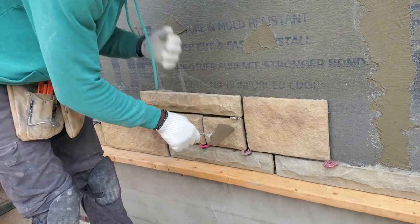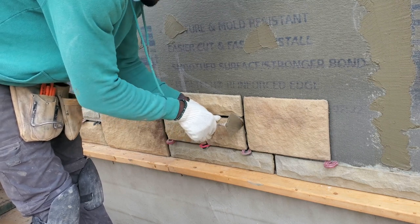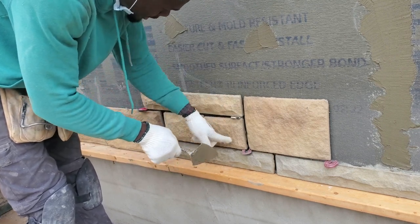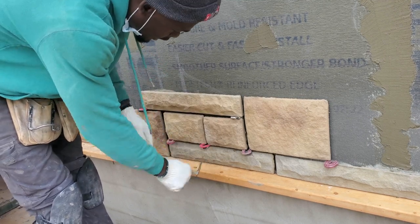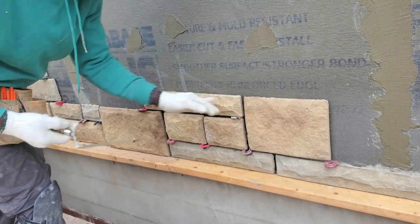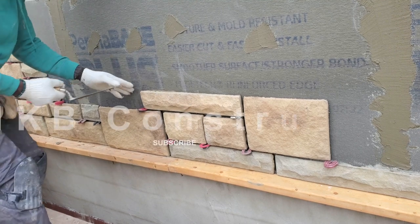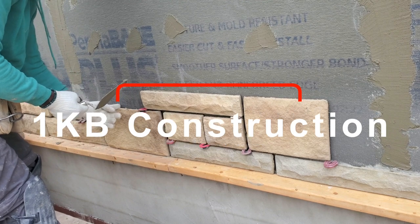It's important to make sure that the previous stone matches up to the new one. For instance, this one is already here — you want to make sure this one and this one are in line. A medium and a small have to add up to be the same as the big one. So the moment you reach up to a medium and a small, it's the same process — you have to go across to break it. This line here is already around two feet six, so you can put a different size right in front of this line to break it, so you don't go more than around four feet.